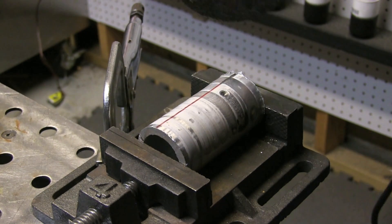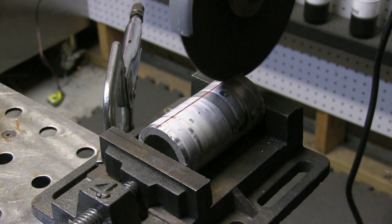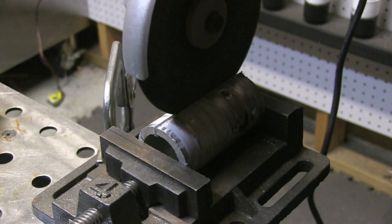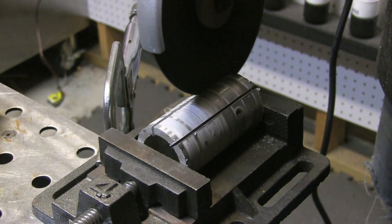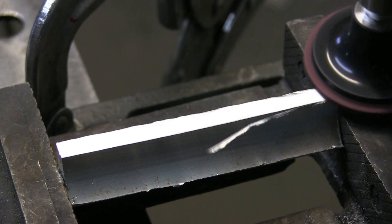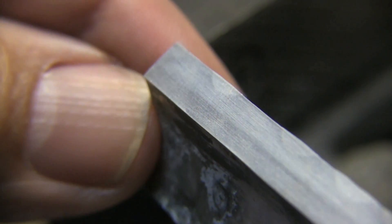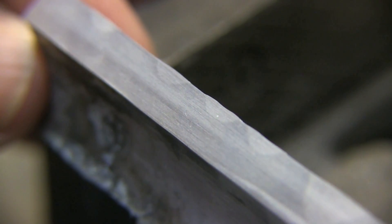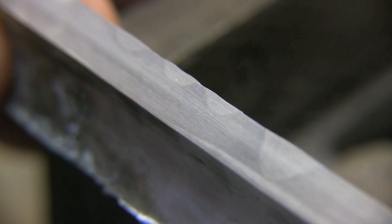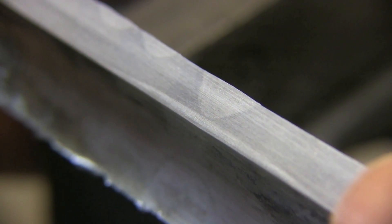Metabo 6-inch. I put a little Irish Spring bar soap on when I'm cutting aluminum — just keeps that wheel from loading up. There's also a more practical reason for using bar soap: it washes off the part thoroughly if you want to get parts completely cleaned for welding later. A little quick polish with some Scotch-Brite. I labeled everything starting at one, two, three, four, five — advanced square first. Going to run them by you here because it's not like night and day between those four. They're all very similar in the way that they penetrated, except for the last one. That's some crazy penetration — all at 175 amps.